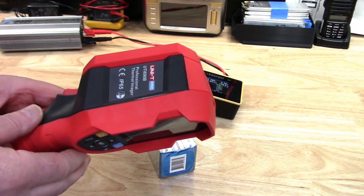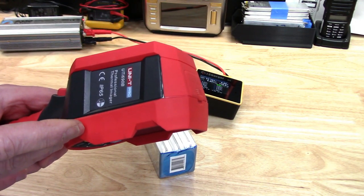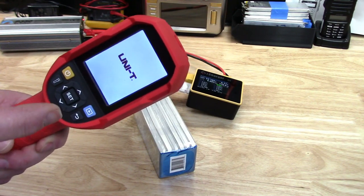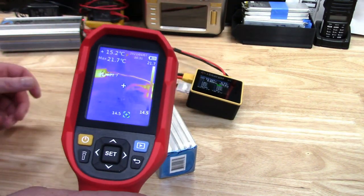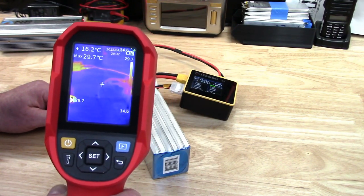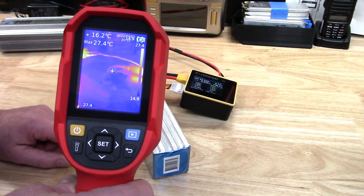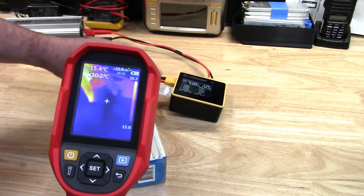What I really like about this thermal imaging camera is the ease of operation. If you've never used a thermal camera before, no problem — it's as easy as turning it on and starting to use it, there's no setup or messing around. It takes about 25 seconds to boot, so boot-up time is not exactly quick. We'll start by looking at a LiPo battery charging to see if there's anything unusual. If one of the cells was getting hotter than the others, it would indicate high internal resistance, but that's not the case with this brand new pack.